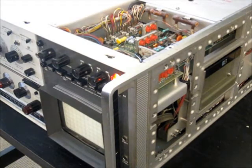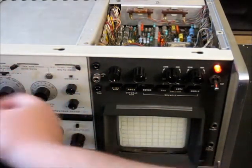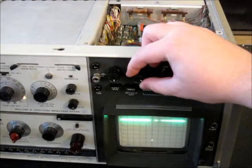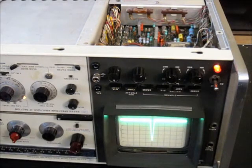The test recommended in the manual is that when you write something to it, it will stay on the screen for at least 15 seconds. I'm going to set it to internal sweep with a fairly slow sweep, turn the intensity up a little bit so it writes, then turn the intensity down. The trace is just being stored on screen by the flood gun refreshing the phosphors. It's staying there well over 15 seconds and it's not blooming out either. Watch out for intensity set too high in storage mode, as it'll start to bloom outward and fill the entire screen with the trace.